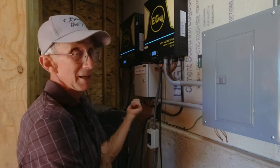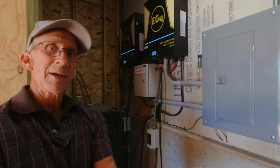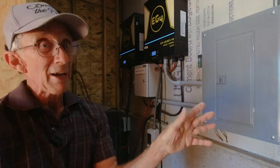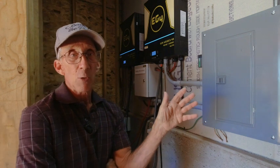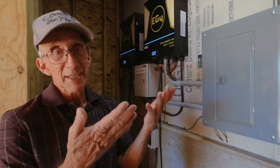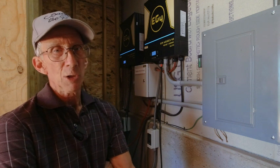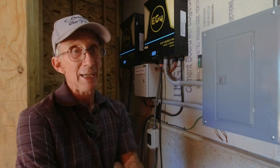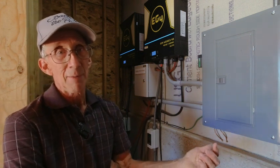I'm really pleased having solar panels that put out more than their rated wattage, and that's largely because of the bifacial design. You can use them on a roof, but on a ground mount system they work great — especially when you can give them a light-colored surface to reflect light back to the rear of the panels. On a roof, even a white-shingled roof, I don't think you'd get anywhere near the backside output that I'm getting with a ground mount. I really recommend bifacial panels for ground mount, not so much for roof mount.